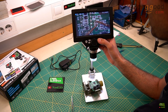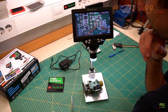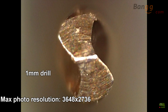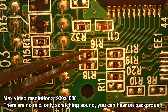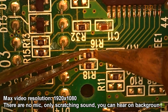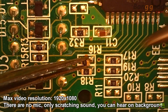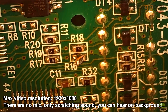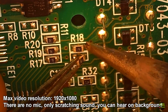Of course you can also review the clips and photos you've taken, which can be useful during repairs to check results at any time. On the SD card, photo files are in JPG format and each is about 300KB, with some larger ones but not over 1MB. Videos are captured in MOV format at full HD resolution in 5-minute clips — if you record longer it creates a new clip after 5 minutes — and every video file is about 550MB. Also note that even short recordings are saved as files, and the video has no audio as there is no built-in microphone unlike the G600.